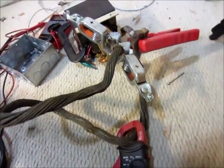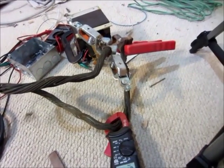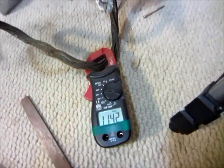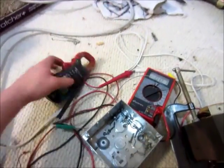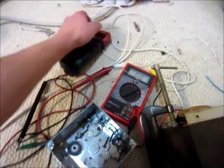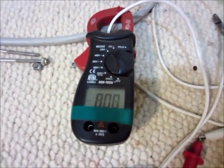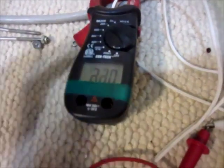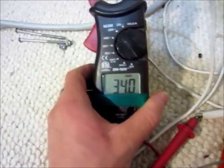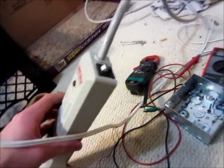I just have it clipped on there and it's good and sturdy. 142 — and the thing just popped there. That's how long it lasts — shorted out on 150 amps coming out there. I should check the input amps. Let's see the input amps. Oh my gosh — it's off the 20 amp scale. 34 amps coming from a 25 amp outlet. That's a lot — no wonder it's popping the breaker.